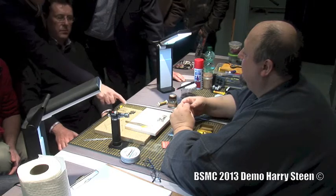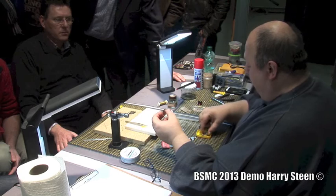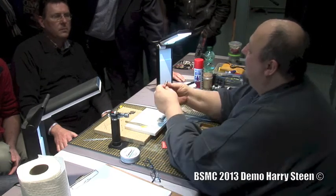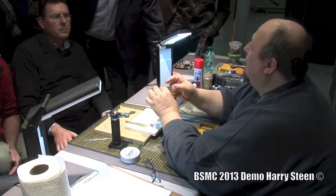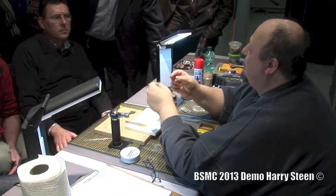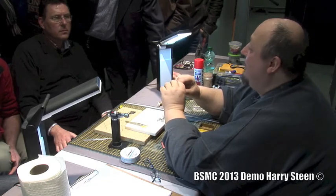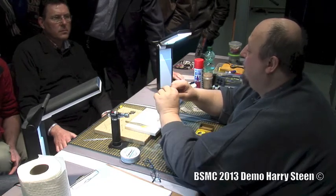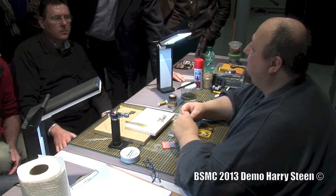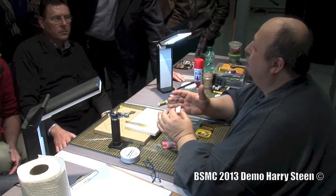So when you have a longer length, it's only necessary to solder the ends. What I would do is pre-tin maybe three spots here, do the same on the other piece, then put them together, put some flux into the crevices, heat it up and it should be good. And even if only two spots are sticking, it's going to hold on.